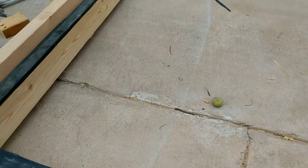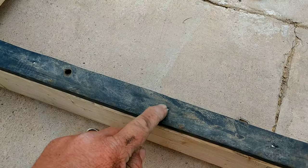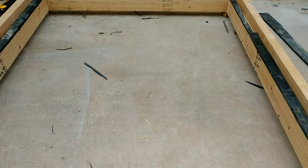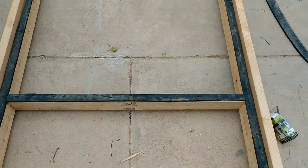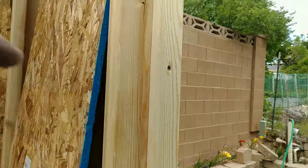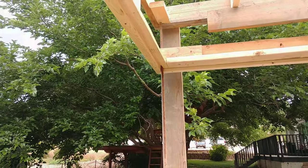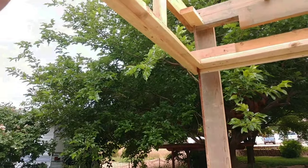This frame is for some windows going in the roof. I have this rubber that I used with finish nails — I countersunk them a little bit because I don't want the glass sitting on the wood or on the nails, so that way it shouldn't break and it should put a pretty good seal on it. I'll caulk it also but that will come later. On these 2x4s I screwed some inch-and-a-half by three-quarter inch little trim pieces — I purchased these since I didn't have my table saw. It goes around the whole thing so we can push the glass up against there and it won't fall through. It'll stop and then we'll secure it from the inside.